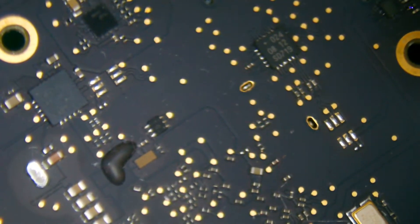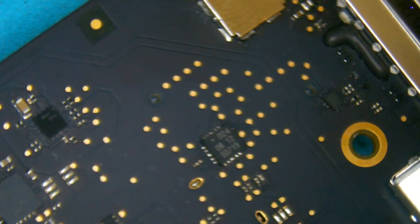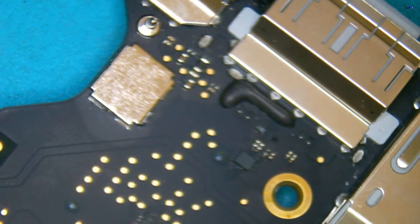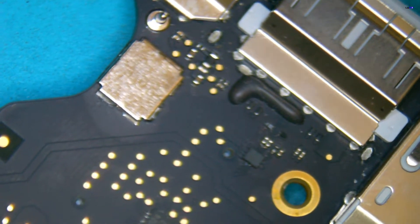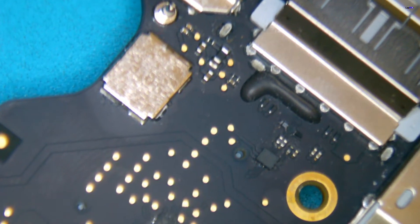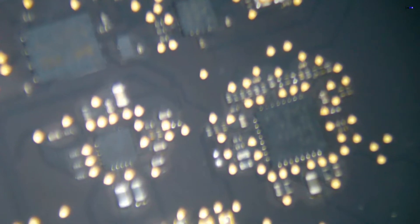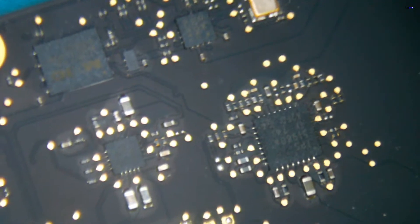The SMC has roles — it can also control thermal and power management, input/output, video mode switching, and lots of different things, especially battery charging as well. If something was impacted like this, it's definitely a major blow and a lot of this does go bad. If the SMC is bad, then you have a pretty big issue. But it's usually the one you can see, often taped around with glue, especially on A1466 models. It looks pretty clean — nothing looks damaged, no liquid spills, nothing really wrong.